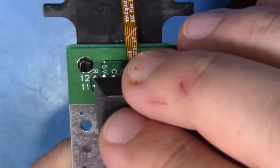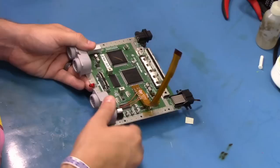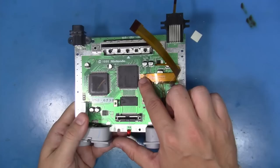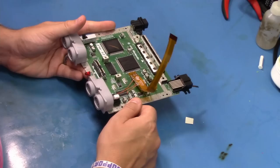Okay, let's move on. Now it's at this point where all the soldering is done. Naturally, once again, make sure you inspect all of your soldering to make sure you have no shorts, no bridging, and that everything is in sound and good order. We're ready to put this together. We'll be using the 3D printed components that I talked about earlier. Let's bring the shell back into play and get that situated. When putting our 3D printed part together, the first thing I'm going to do is remove this little metal tab right here. I have the base for the 3D printed part by LaserBear Industries, and this fits in just like so.